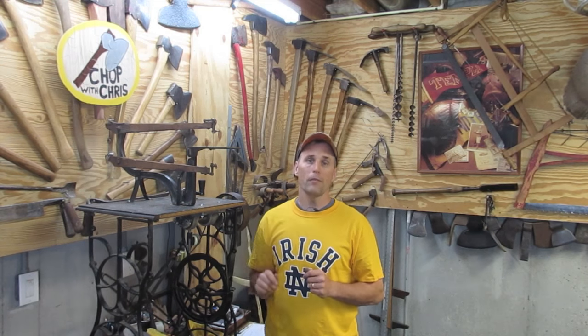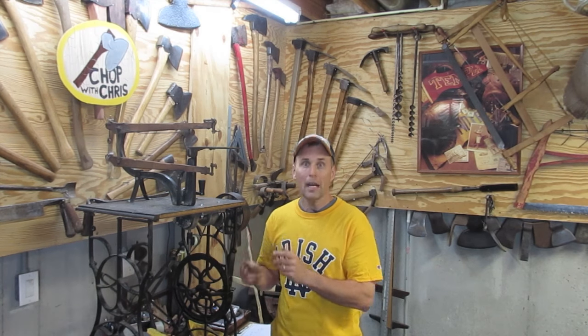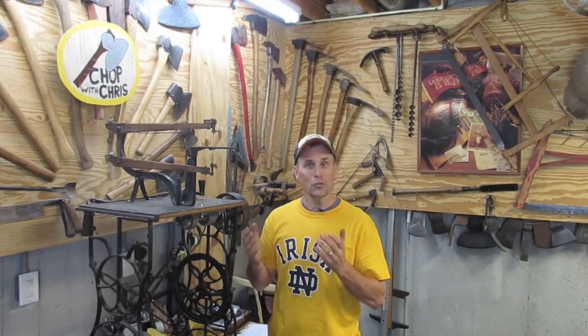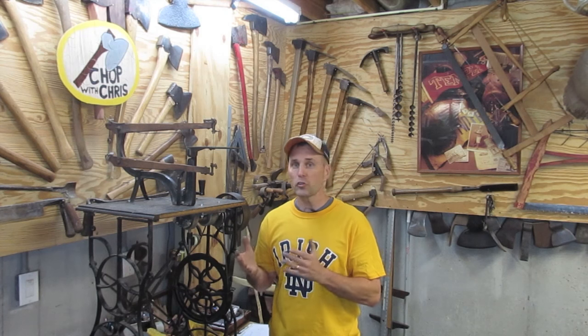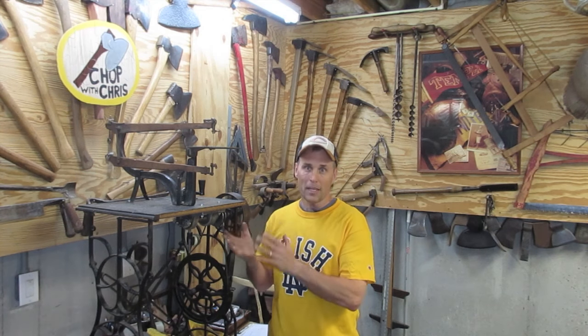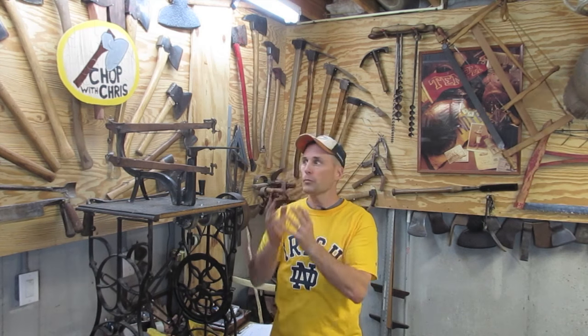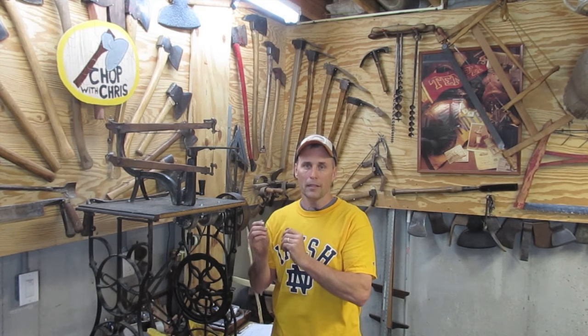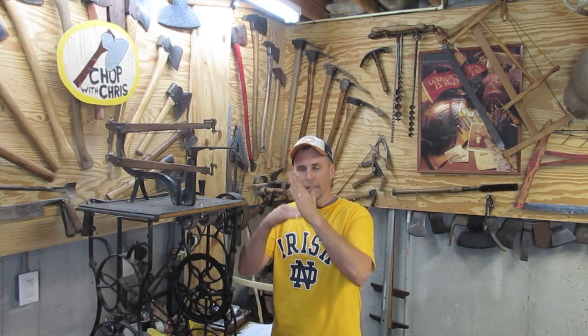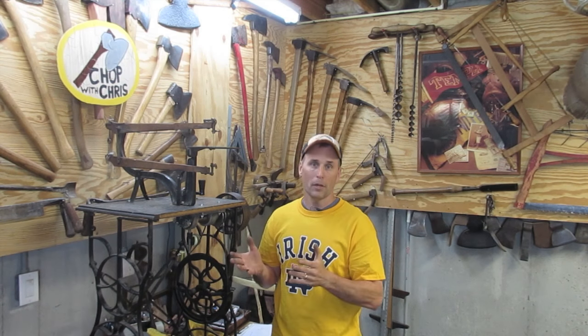For my third and final learning slash mistake: I started to use it again and broke two more blades — that's a total of six — but this was truly a rookie mistake. Before I built this scroll saw I'd never used one before. I realized I had the blade upside down. The flat portion of the blade was going up, which would pull the board up and cause the blade to break. Once I got the flat portion on the downstroke, it held the board in place and the blade didn't break anymore.